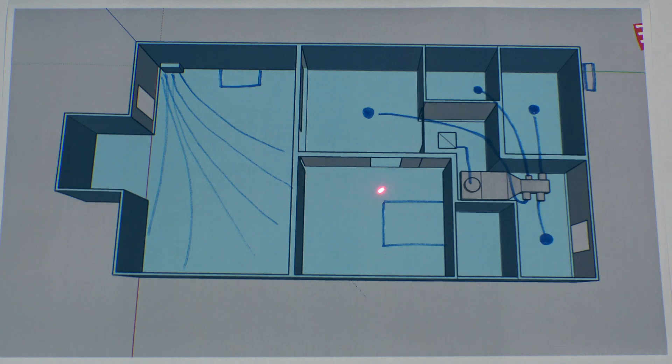We were able to avoid all that and get away with just one single ductless in this room. Moving to the second half of the house — we did a heating loss and cooling load calculation on each half. This side has a bunch of small, closed-off rooms, which throws out the idea of putting a wall mount unit in one spot and expecting air to travel through walls into other rooms. We also don't want to put a ductless head in each room because these rooms are too small — the smallest ductless unit is around 7,000 BTUs, while an average bedroom may only need 2,000–3,000 BTUs.